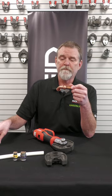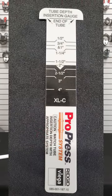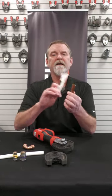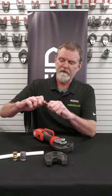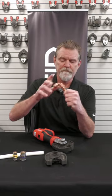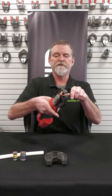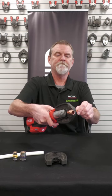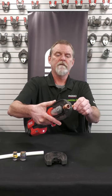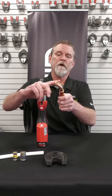If you want to pre-mark the tubing, we do have a Pro Press insertion depth gauge so you can put that on the tubing and pre-mark your size. Push it all the way down, make sure it's to the line and completely down. Grab your tool and with one hand put it onto that fitting, run it for a full cycle, and when the tool retracts, that's when you know you're done — and that is a watertight connection.